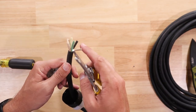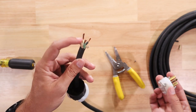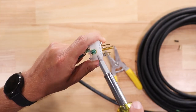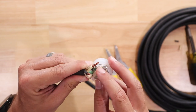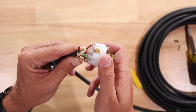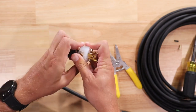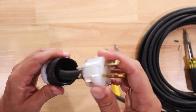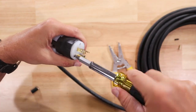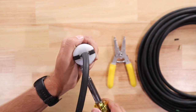I'm going to use my wire strippers to strip off the insulation off of each of these wires - not a whole lot needs to be stripped off. Now I've got all the insulation stripped, and I just need to put each one in its designated slot. I'll start off with the green ground - on the plug you can see there's a green ground screw, and I'm going to put it in the hole by that screw, then tighten it all down as tight as it can go. Next, I'm going to put my white neutral wire into the plug. There's a silver screw - that's where the neutral is going to go. I'll put the neutral wire in underneath of that silver screw and tighten it down. That just leaves us with the black line wire, which goes underneath the gold screw, and then tighten it down. Now I'm going to pull the sleeve and put it up over the plug, tighten down the screws on top to connect the plug portion to the sleeve, then flip it and screw down the screws that tighten the jaws and pull it all together onto this cord.